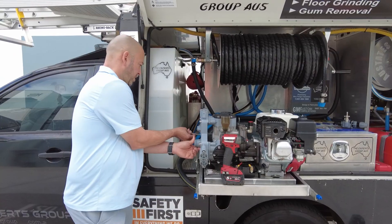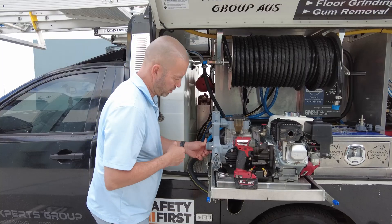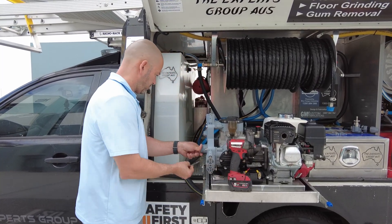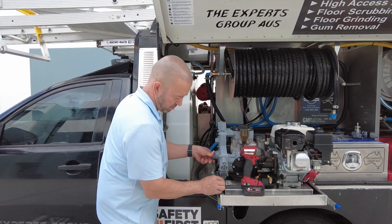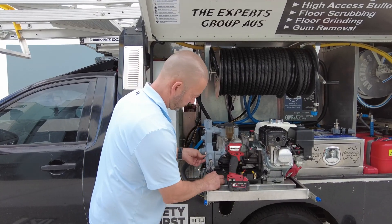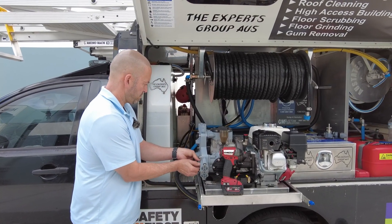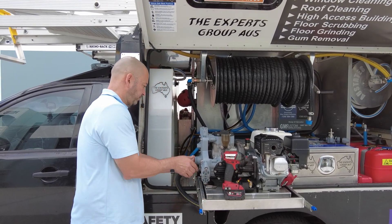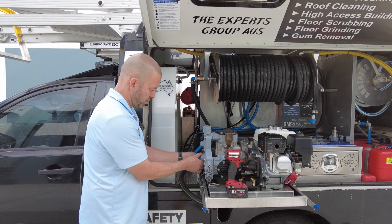Long bolts on the outside, 11 Nm of torque. Those new O-rings are quite chunky, so we're actually going to compress those O-rings between the new monolithic block and the head assemblies. The pump outlet port is in the same spot. The inlet port, as you can see, it's moved — so different location there.